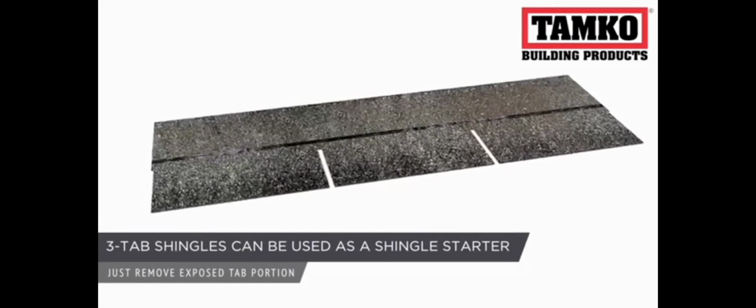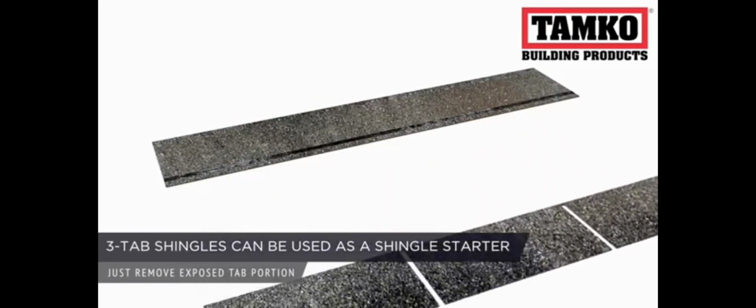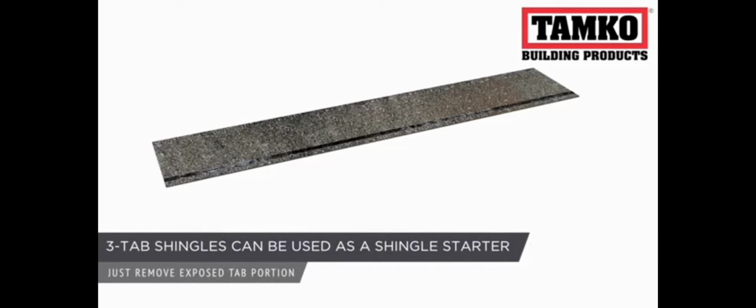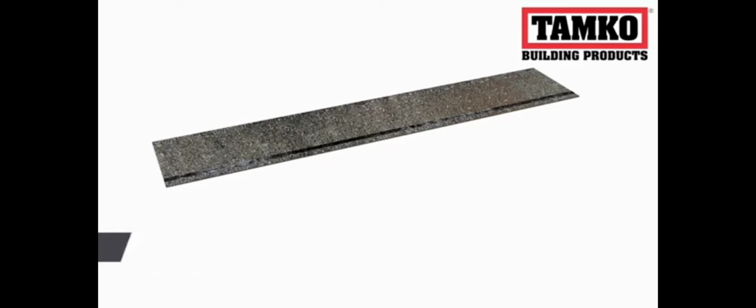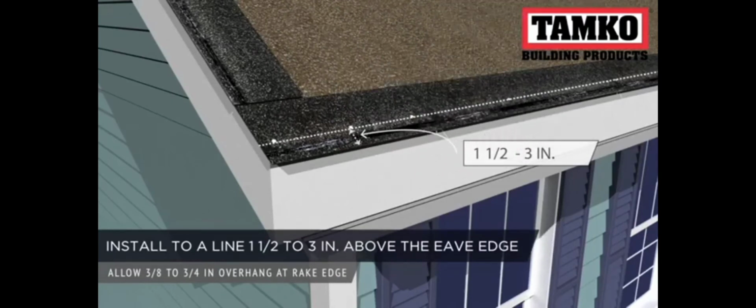While Tamko recommends using shingle starters, 3-tab shingles may be used as a starter. Just remove the exposed tab portion and install with the adhesive strip adjacent to the eaves. Attach the starter strip in a line parallel to and 1.5 inches to 3 inches above the eaves edge.